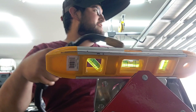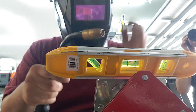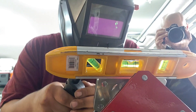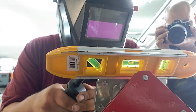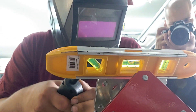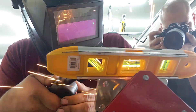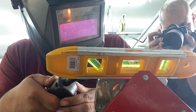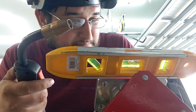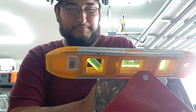What I'm doing now is I'm going to attack the inside, so it would be kind of a good test. Alright, here we go. Needs more heat. More heat. More heat. It's not really penetrating — it just starts stacking up a fat booger on there. It's not really penetrating into the metal.